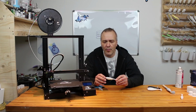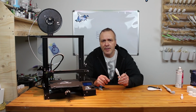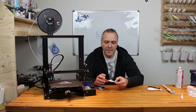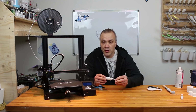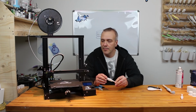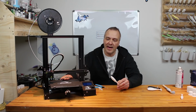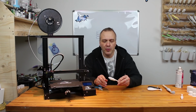So the way some people do is that they take their final print of ABS plastics and put it into a small chamber with acetone fumes. This will dissolve the surface and make it run out and give a smooth surface. So that's for sure something I will try later. But for now, as the ABS will require me to have a glass plate on my heat bed, I will have to do with the PLA.